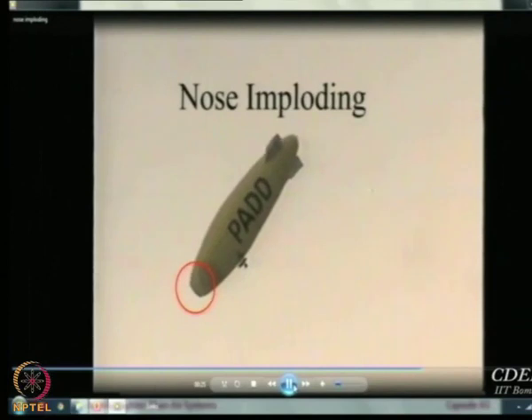This will create extremely high drag forces because the nose is not rounded — it is actually like a flat plate. In this airship, we did not have the luxury of putting any nose battens. During this flight testing, we realized that unless we do something about it — either put the gas under higher pressure, which affects net lift and creates structural loading — the nose of the airship will implode unless you really provide something in the front.